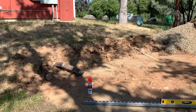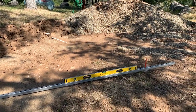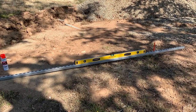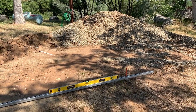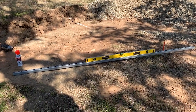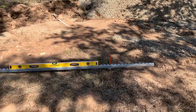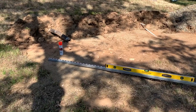You see I took out a little bit of the side of the hill here, to create more of a flat surface. And so the original thought was to make it a 20-foot pad, but I believe the cylindrical tank is about 12, and I don't want to buy more pea gravel and crushed stone than I need to. And so I think I'm going to reduce it to a 16-foot diameter pad, and that's what we got set up here. We got 2 foot burned off on that end, and we'll be swinging an 8-foot arc.